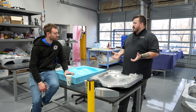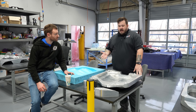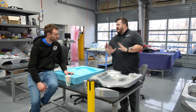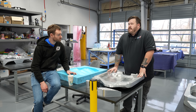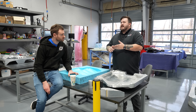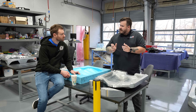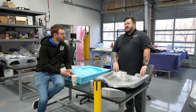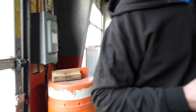Then the next best way — and people will argue about this until they're blue in the face — is out-of-autoclave prepreg. An autoclave is essentially a giant pressure cooker. Out-of-autoclave prepreg is nice because you don't need one to make your parts, and it's pre-impregnated with resin so every piece of carbon has exactly the right amount of resin. It's also much easier to lay into the part. The trouble is it's a very thick resin that doesn't want to flow — it's like trying to fit a square peg into a round hole.